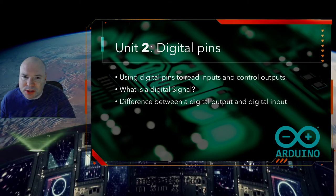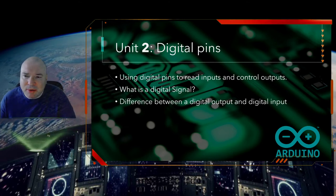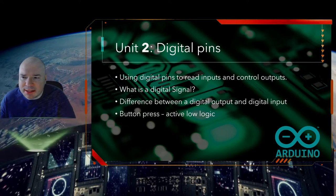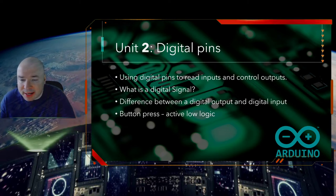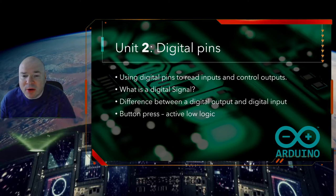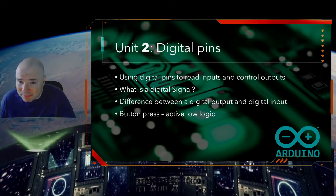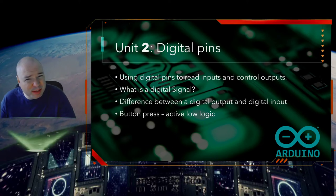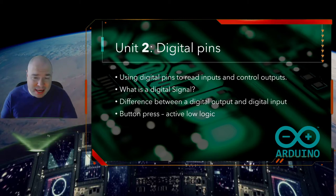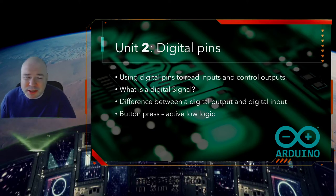That's the difference between the digital input and the digital output. Now, that last part, the digital input: when we have a button and the button is just sitting open in the air, just floating around, there's electricity. We often call it static electricity, or there might be electricity in your body, or on the board. There are electrons all around us. And that sometimes affects the button, in that the button could take on some voltage. It may not be 5 volts, but it may be some volts. And the processor can get confused as to whether or not it's supposed to be detecting the voltage that's there. So maybe there's a static charge of 1 volt, and the processor says, well, there's some voltage there, and it might flip back and forth between 0 and 1. It could get confused.